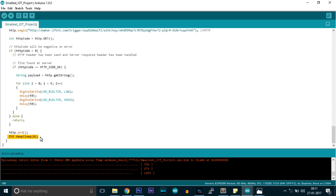In the last part, as you can see, ESP.deepSleep is set to zero — this means that this module will go into deep sleep forever until the reset button is pressed. This is the power saving line of our code — this is the line which saves a lot of power. So in summary, first it will act as a station and ask for the SSID name and password.